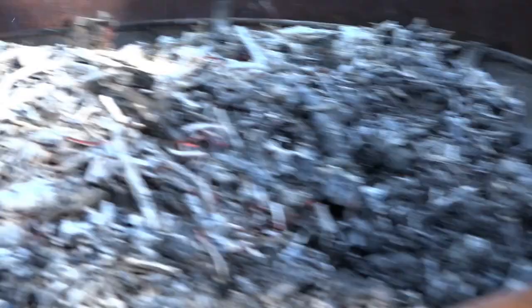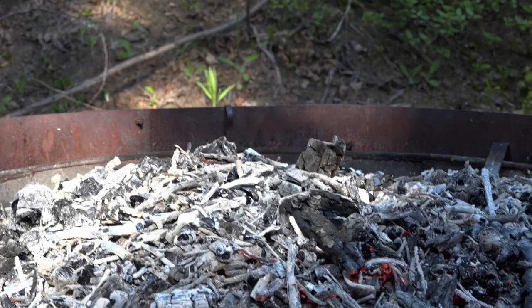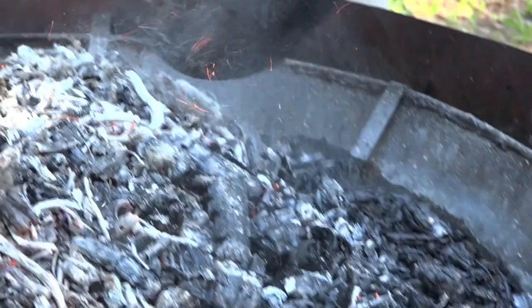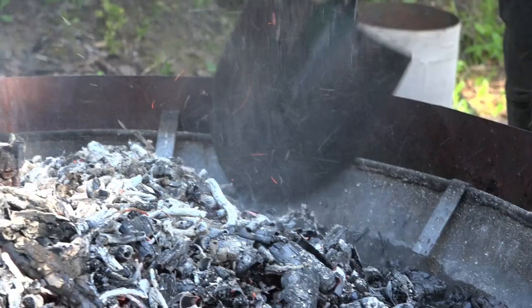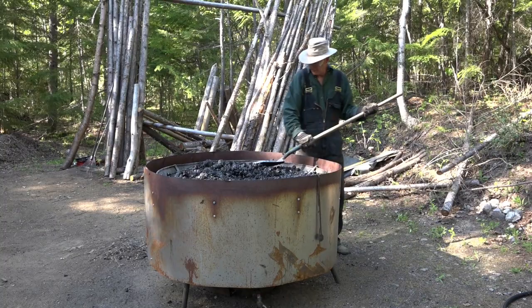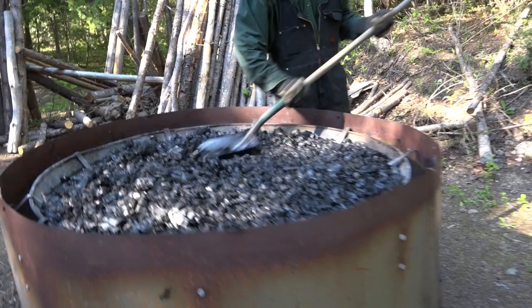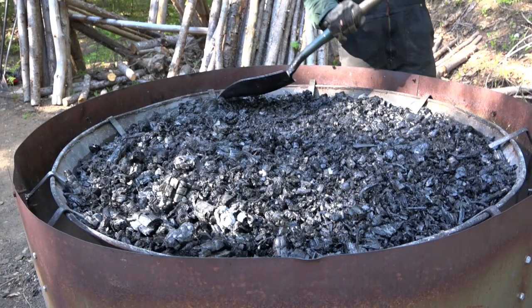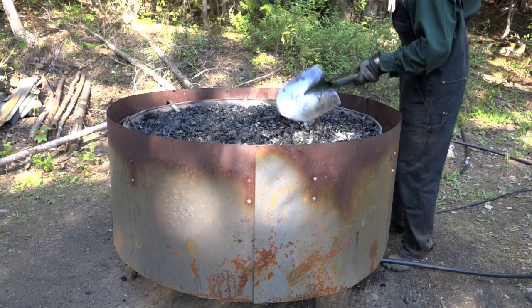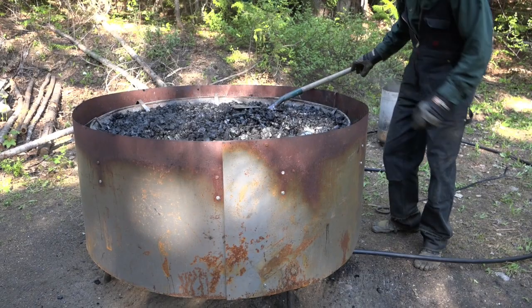The pieces on top — their flame is gone but they're smoking, so they're still not done. Once all the volatile material is gone you end up with no smoke and no flame. The charcoal tends to float too, so you can't just fill it up and hope it'll go out because the top will float and it won't quite go out. I can shut the water off, and once I don't hear any more sizzling, that's it.